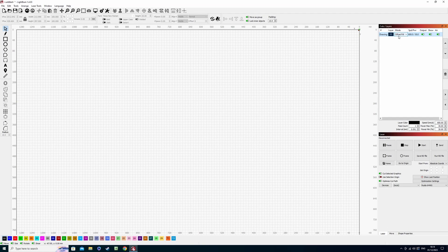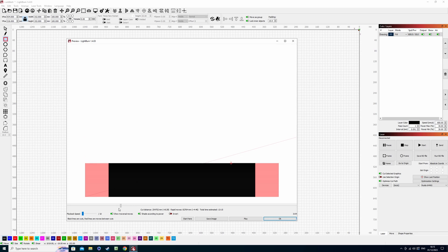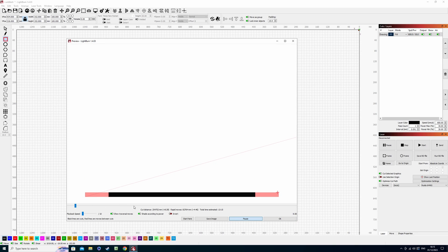To show you the benefits of what this can do, I'm just going to draw out a square. We're in fill mode in the cuts and layers tab. Coming across to the preview window, this shows us how the laser is interacting with our project. If we wind this all the way back and hit play, you can see this cursor is moving from left to right or right to left, and it's going to keep doing this until the whole square is filled — this is typically how most laser projects are engraved.